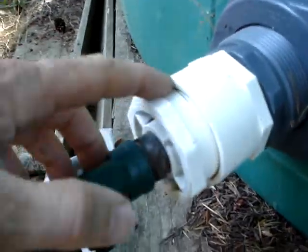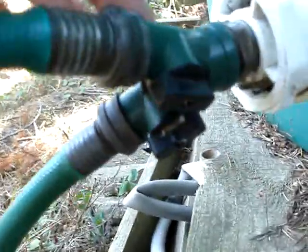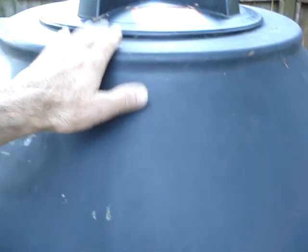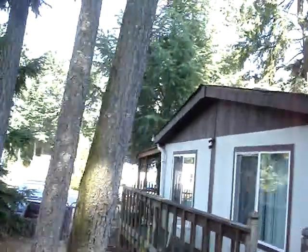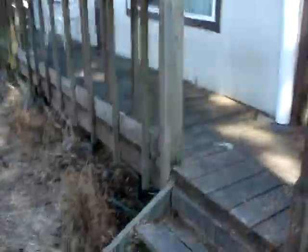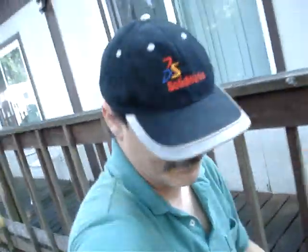Here's the fitting on the tanks. All I want to do is put 2-inch PVC line in here instead of these hoses, so I get better throughput. Right now with the garden hose, during a heavy rain it just doesn't fill because there's a lot of resistance through these small-size hoses. I'd like this front tank to fill first, then the second one will fill. I'll build a stand, put a fence around it – the porch connection, the middle connection, and the downspout connection on the side, all running through a manifold – and make it all PVC so I can take it apart and put it back together to clean it, move it, or whatever. That's my setup and that's my plan. Have a great day, bye.